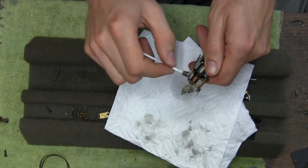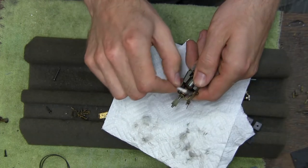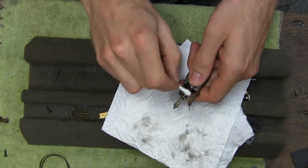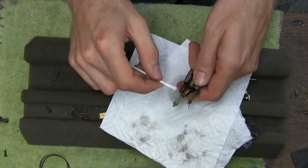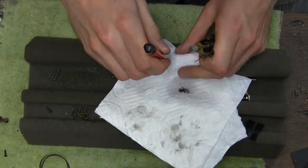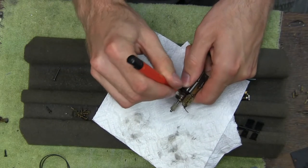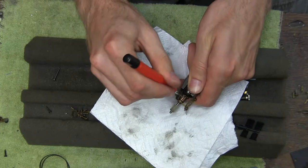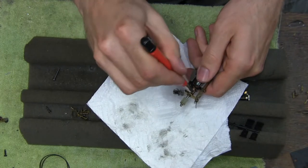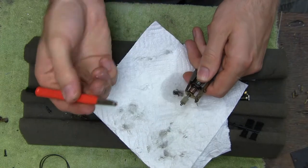The gaps between these commutator pads look really clean — there's not really any buildup in them. This is cleaning up quite nicely. I'll wipe it dry with the dry side of the Q-tip so it doesn't leave much residue. I think this is a 5-volt motor, which is actually kind of fancy. I have this polishing tool — haven't been terribly impressed with it, but I'll give it a shot and see if it'll do some polishing. Yeah, it's getting real shiny now. It's good at polishing, just not good for heavy-duty degreasing — you'll kind of ruin it early.